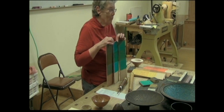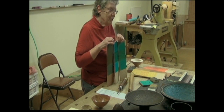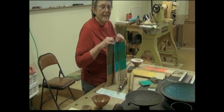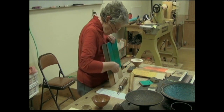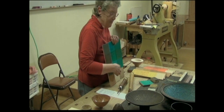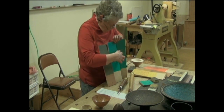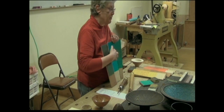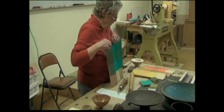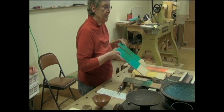They start with white fabric, white paper. And then I thought, well, what if I bleach my wood and then add color? Then I get much better color. It really is what you're after. So if you think of this blue on the maple, the bottom row is without any finish on it. The next is with oil, which yellows it. And then I used, I think, a spray Deft lacquer. So each one of these, it's just remarkable to know.